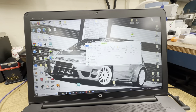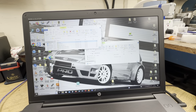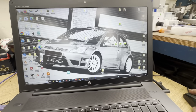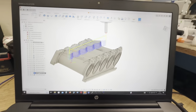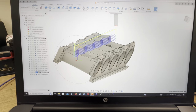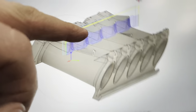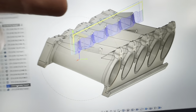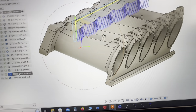So let's copy this to a USB. Every time I go to do a video the compressor seems to kick in. I actually realized I've got a much shorter 12mm tool with a 2mm radius on it as well, so we've changed it. We're going to do it in step downs because with the trace toolpath you can't do step overs — I'd go full depth and step over — but I'm going to do it in 2mm step downs.